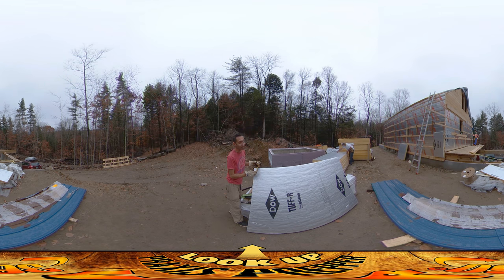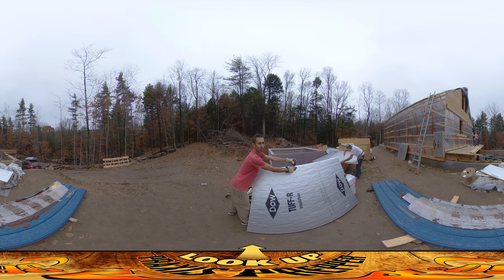So I told him, the time when I do use the lock is for marking these foam panels — and apparently this is something he described as ingenious, or at least beneficially useful. It's a useful technique; I've been using it a lot and it saves a lot of time in measuring and marking. So oftentimes when I want to mark up one of these sheets of foam and cut it in a certain shape, I'll set the tape measure to a certain size. Right now I want to cut three inches off the side — I'll set it to three inches, rest the tape measure up here, and just push the little metal blade at the end of it slightly into the foam, just enough to make a little mark.